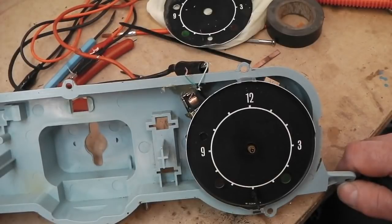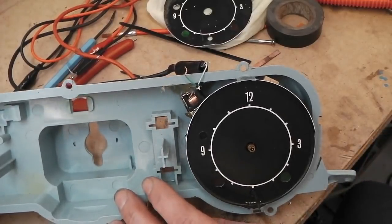And I could fit a feedback sensor on the fan that actually tells you if it's actually revolving or not, rather than just that the relay's on, because you could have the fan relay on but the fan motor seized and doing no rotation. So you could fit a little sensor on the fan blade shaft quite easily and link it into this, so it gives you a true indication that you have electric fan cooling, because that's the downside of an electric fan.